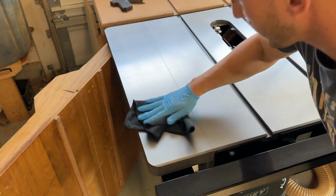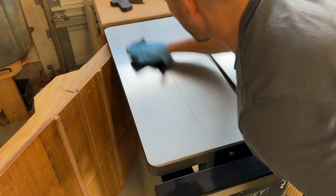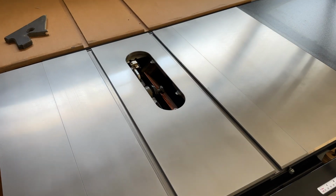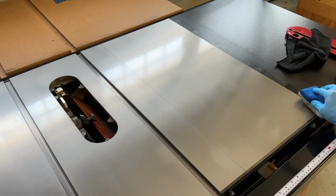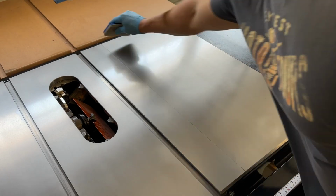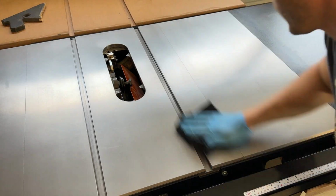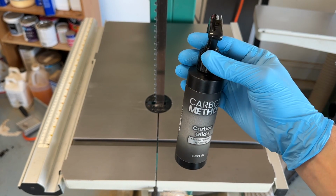Again, you do your initial coat, let it sit for 60 seconds, do a leveling pass where you're just going to angle the application pad at 45 degrees and lightly scrape it across the surface, wait another 60 seconds, and then you're going to buff it out with a rag. And then that's one coat. And you need to wait an hour in between those coats. So you can see if you're doing 3, 4, 5 coats, this is going to be an all-day thing.